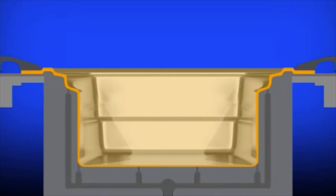Some regions stretch more than others and this causes uneven sheet thickness. In this part made in a female mold, the thickest plastic is at the top flange. The sheet becomes thinner as it is stretched to the bottom of the cavity. The distribution of the sheet in this female mold is thickest at the top flange, thinning down along the walls, and thinnest at the base of the molded part.